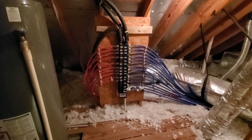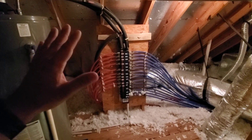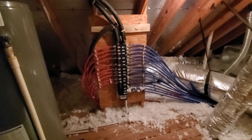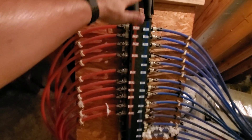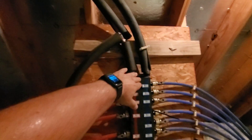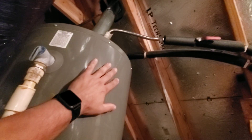We're up in an attic, and here is a shutoff manifold — you don't usually see shutoff manifolds in the attic too much here in the Houston area, but as we can see, they do exist. What I like about this is it's all very open and easy to see. Here's the main line coming in and it supplies water to the entire manifold. There's a big line on the cold side coming out with a shutoff valve that goes to the hot water heater.